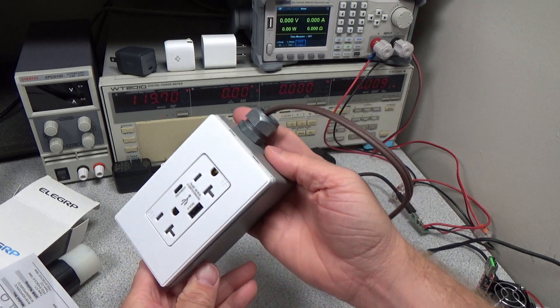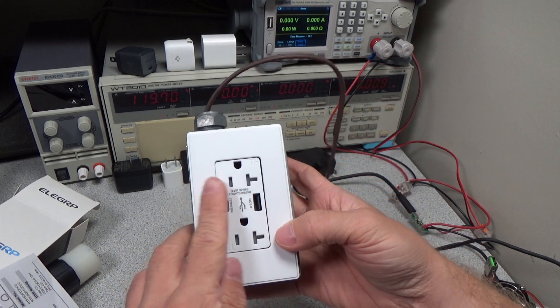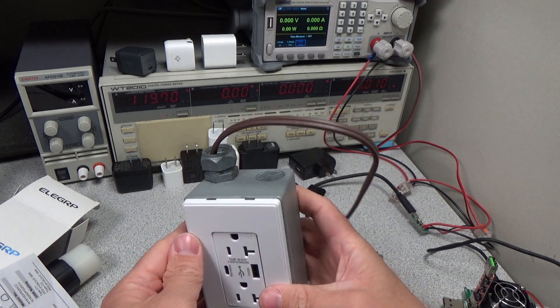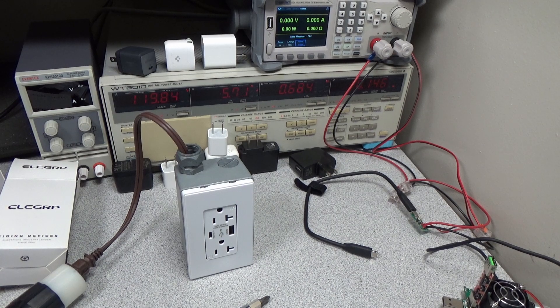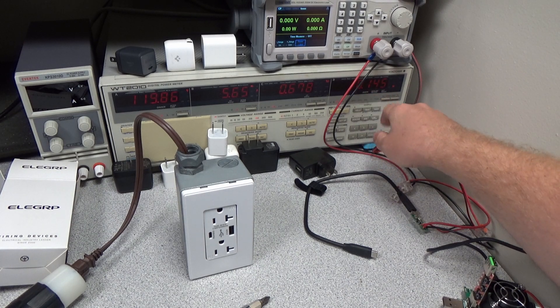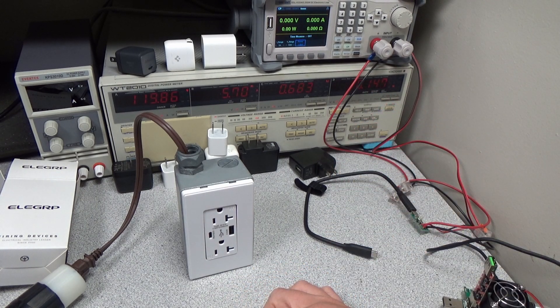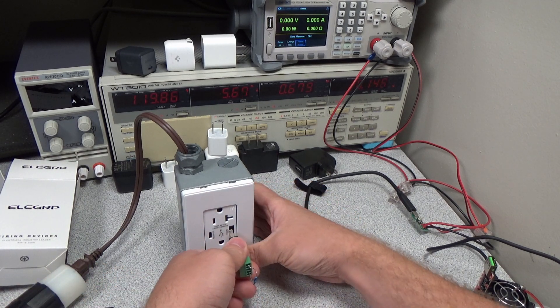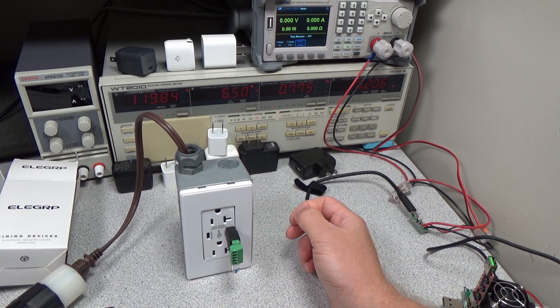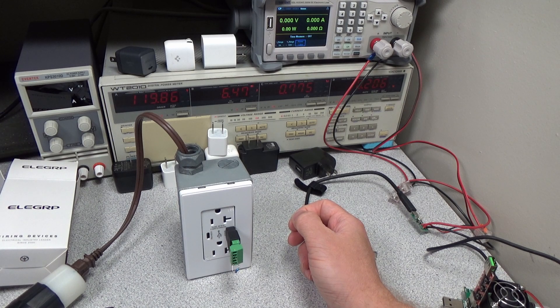I did a video explaining some power quality metrics — there's a link below. In general, I will just state what is good and what is a bad number. Let's plug it in and check out the idle power consumption. Looking at the idle power in VA, it isn't great. The power factor is very poor at 0.2, but this is also only at 0.15 watts. These results are fairly mixed since the THD is also not that bad at these lower levels, probably because of some extra AC line filtering in the larger space.